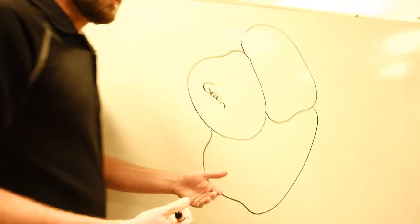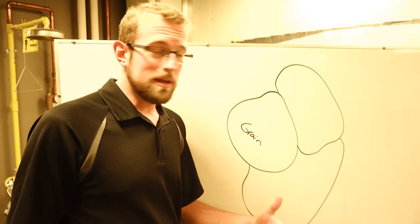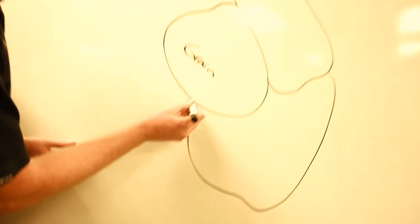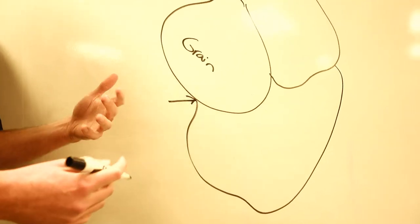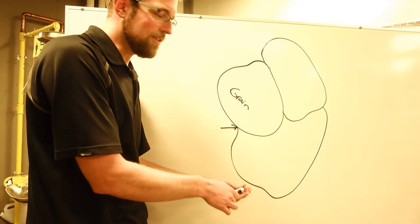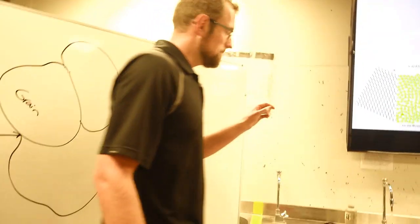The important thing to understand with grain growth, and the reason why these crystals are going to grow when we heat our material up, is actually because of the boundary between them, what we call the grain boundary. This grain boundary, the separation between them here, is not part of either of the crystals that it's next to. It's next to this neighbor here, it's next to this neighbor here, but can't quite join either of those crystals. And so it ends up looking something like this.